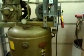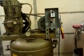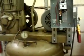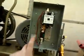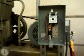And I see that as very useless, because the only time I feel you really need to purge this is when you're actually using the compressor. So therefore, when I go home at night, I don't need this thing purging and then maybe triggering the compressor overnight, because it's purged that many times and lost that much air. So the idea is to tie the 220 volt electronic tank drain into the contactor on the bottom side. So the only time the tank drain will get electricity is when the contactor is closed and the motor is running.